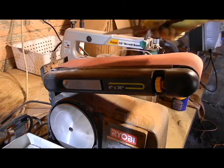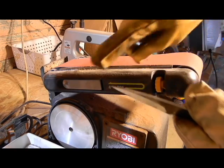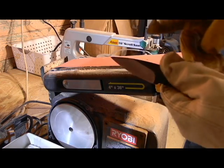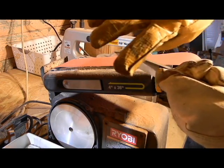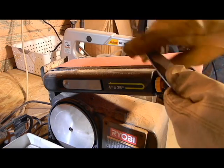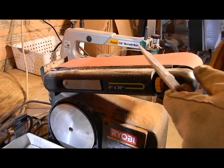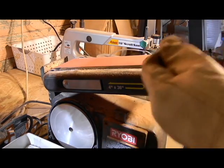One thing that we do need to do that I haven't mentioned yet is we're going to grind the top part of this blade, the part that's not going to be handle material, if you will. We're going to sand that down fairly fine and buff that with the blade. Remember, we want that blade buffed up nice. Make sure that there's no big scratches in there. Right now, let's go ahead and take the sides off.